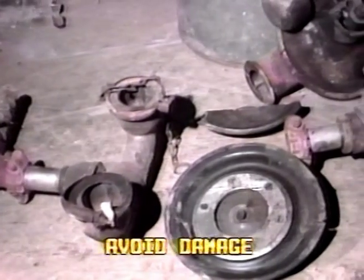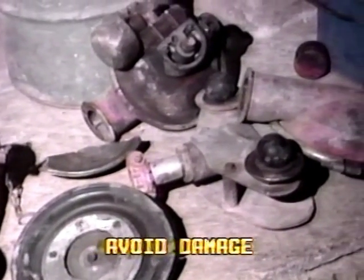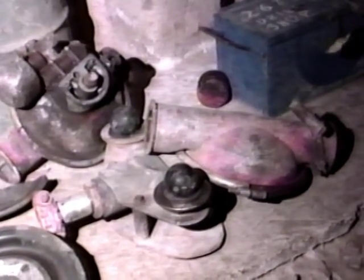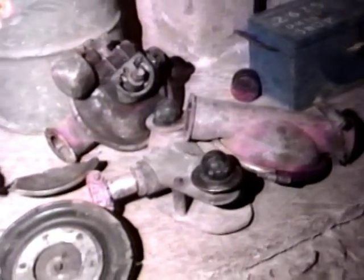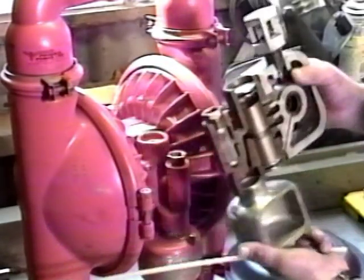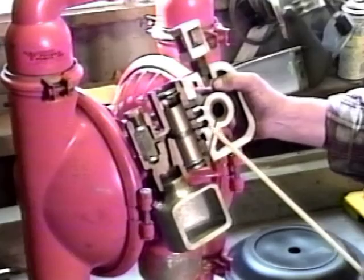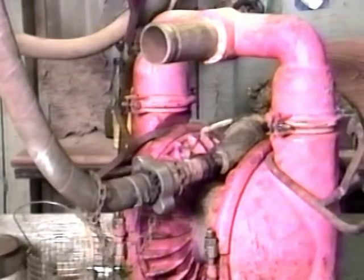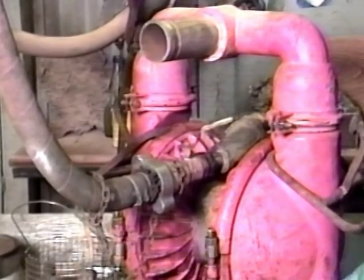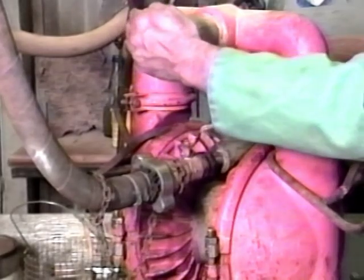Four: avoid damage to the external parts of the pump. The external wetted parts are investment cast 316 stainless steel. Make every effort to prevent damage due to being dropped, collision with other equipment, and other destructive situations. The air valve body and piston are constructed of brass and aluminum and should be treated with care. This part contains a patented one moving part and should not be abused or tampered with. These procedures are few in number; however, if observed, they will ensure a superior, highly reliable pump you can count on when needed.